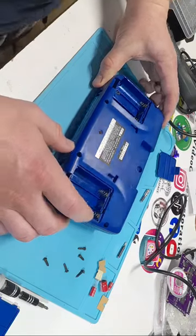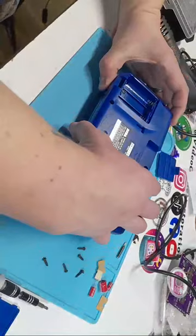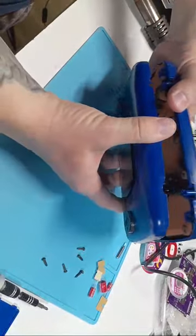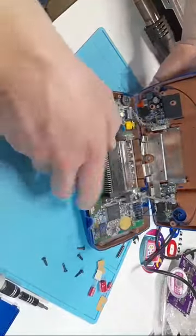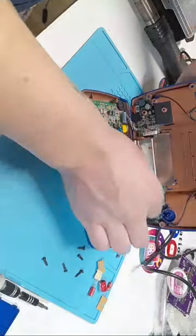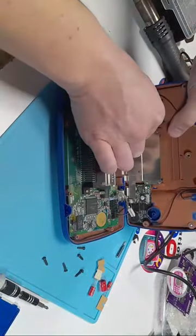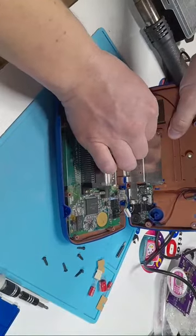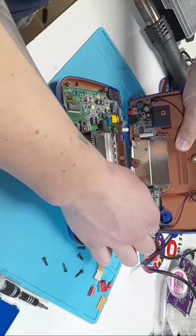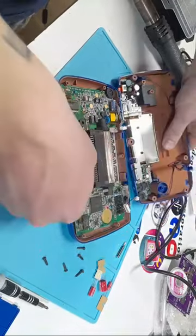Console Karen, yeah, basically. Okay, so once those 6 screws are removed, you'll be able to just pop off the back here. Now be careful because there are going to be wires holding in your power board as well as your audio board. Easy enough though, you just pull on the side and those tug out. And again, pull on that, just slightly gently wiggle it back and forth, and then you're also gonna unplug your speaker. Come on, speaker, there it goes. So that is out.